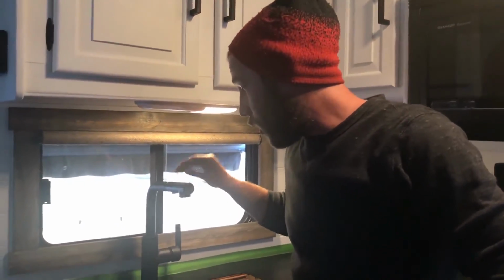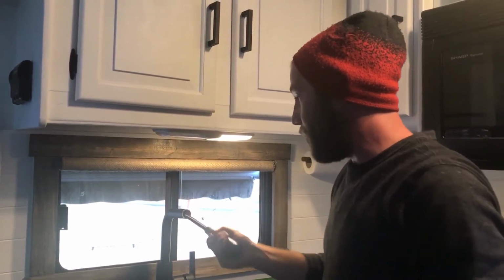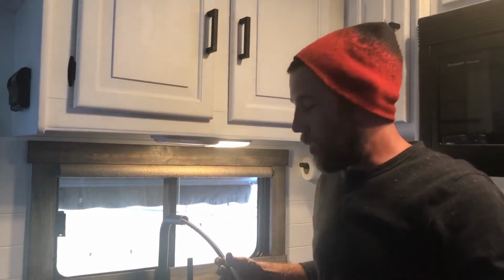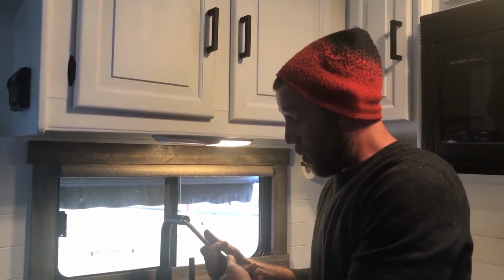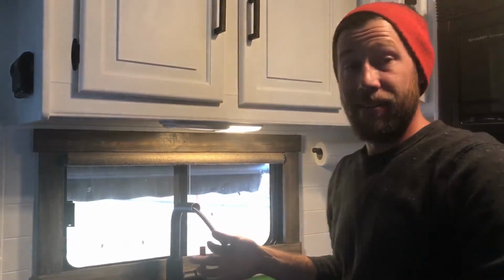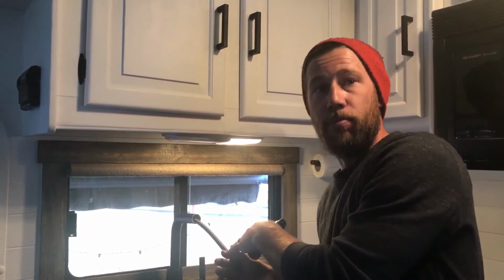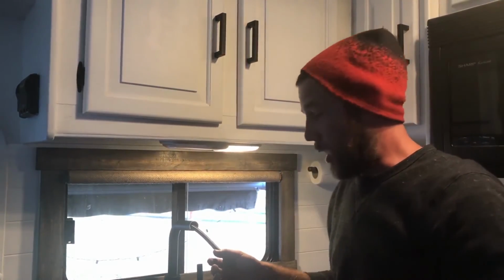Alrighty, so our faucet is all installed. Our water's connected. We've got our hose for our top piece installed with the weight on down below. Now the next thing they recommend you do is you turn the water supply back on. You go ahead and remove this front piece, and then you have the water spray out of here without this on there, so that if there's any debris or anything in the pipes, it'll go away and not through your nozzle.